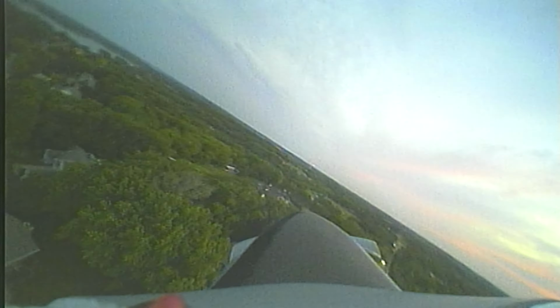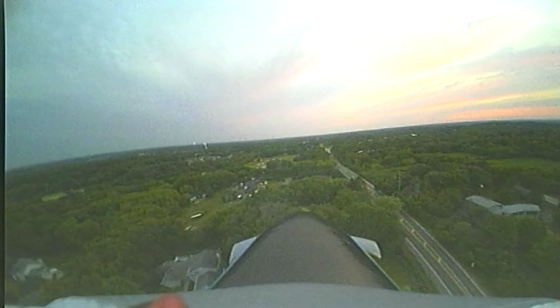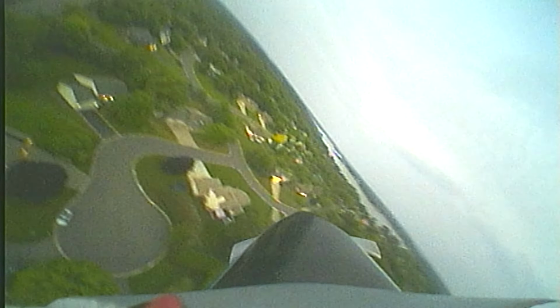The good people at E-flite made this plane waterproof out of the box in case you wanted to throw on this float set, so you don't have to do any extra conformal coating or anything if you don't have a camera on the top. Now, if you do have a camera on the top, like what we have, we would suggest throwing on a little bit of conformal coating to any exposed electronics just to make sure nothing gets wet in case of an unscheduled submarine expedition.